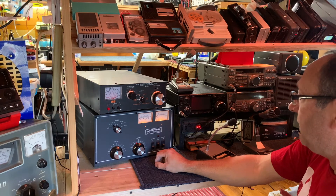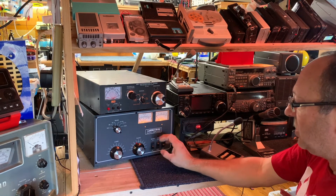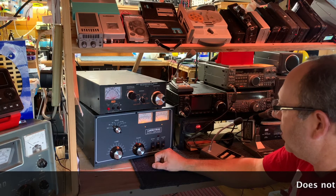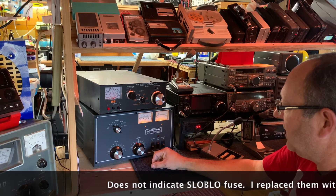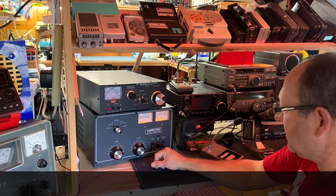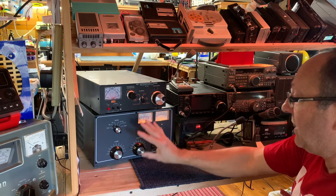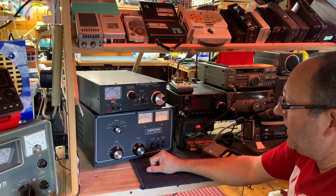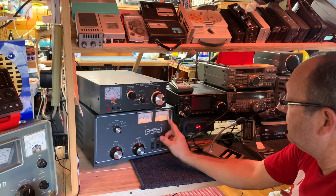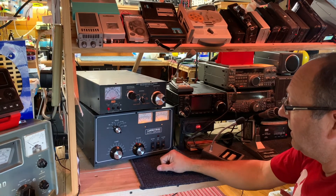I had an 8 amp fuse in there when it's supposed to be a 12 amp fuse, and I replaced it with a 10 amp fuse and it didn't hold on startup. I think I need a slow blow — that's what they're called for. I'll double check the manual to see what the Ameritron manual calls for. It probably should have a couple of 12 amp slow blow fuses. But I won't put slow blow in unless that's what it calls for. In any case, that was a pretty simple repair — at least that's what I think. There could be something loose in the amp that shorted, but I really think it was just an underrated fuse. That's a good lesson and something to be aware of with your equipment. Thanks for watching Vintage Tech.